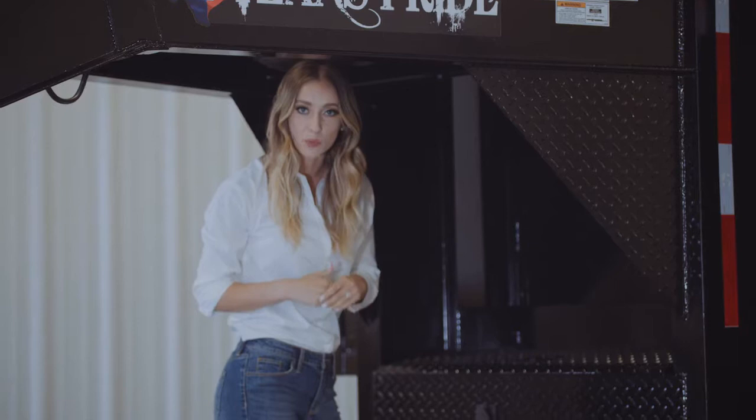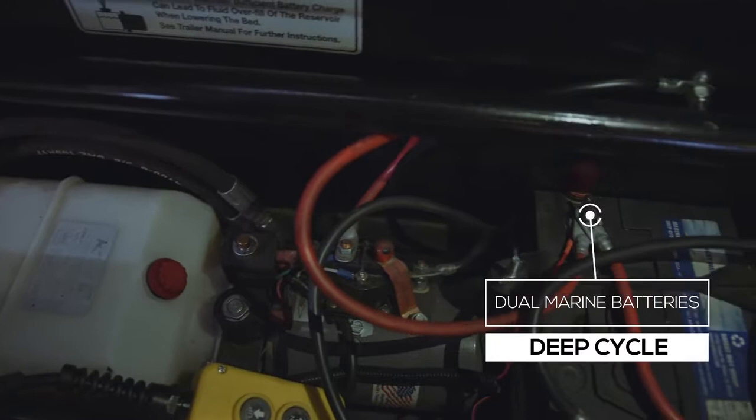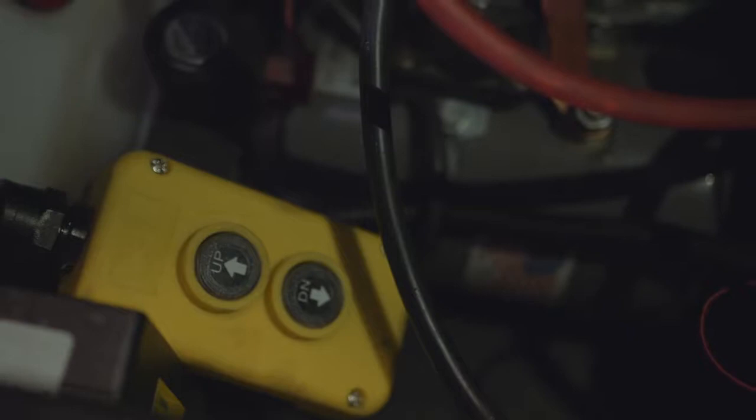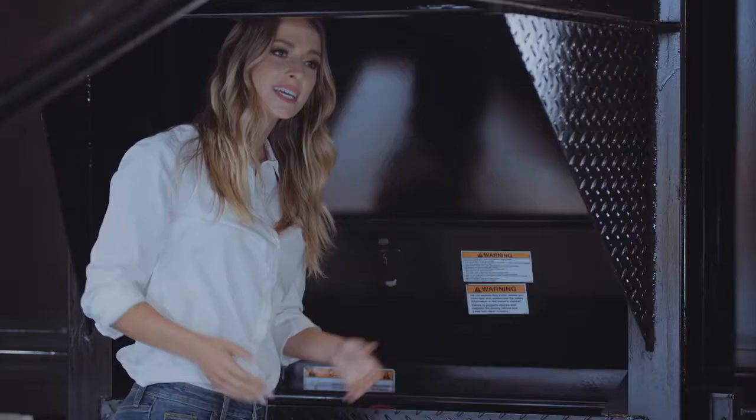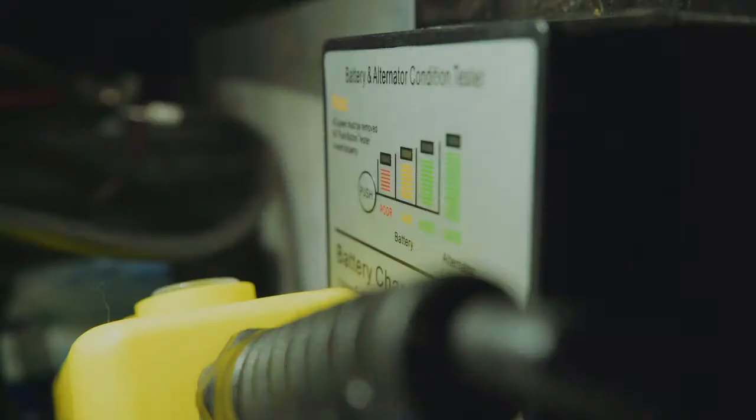In the center of the tongue you'll find the locking pump box that houses the dual high-capacity marine grade batteries. This powers the electric over hydraulic pump. One main feature of our pumps is that they are power up and power down — meaning the pump uses the battery instead of gravity to make the bed come down. This is very important in cold climates and in the winter season, as without this feature your dump bed can get stuck in the up position when the hydraulic fluid gets below optimal temperatures.